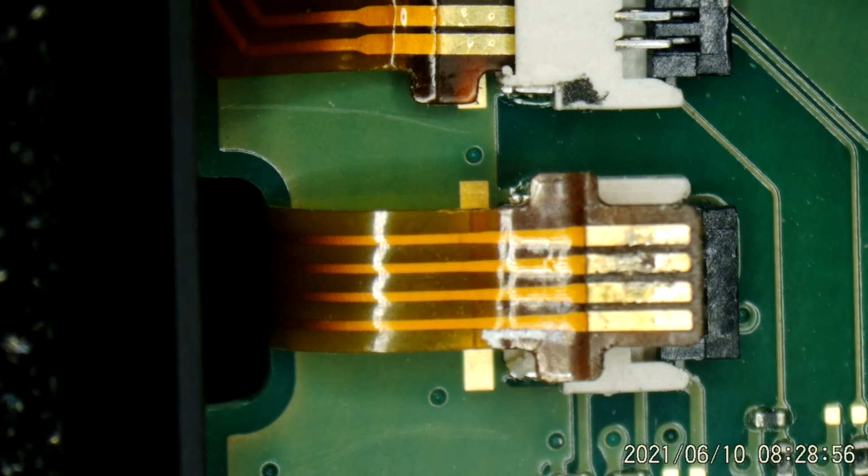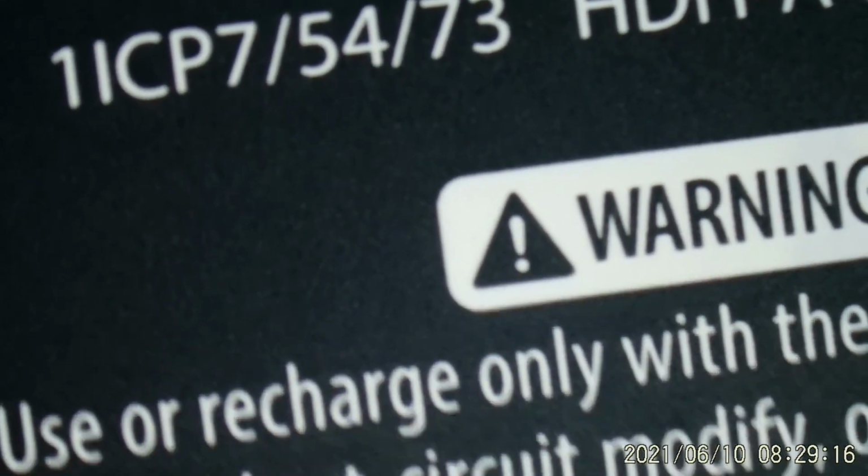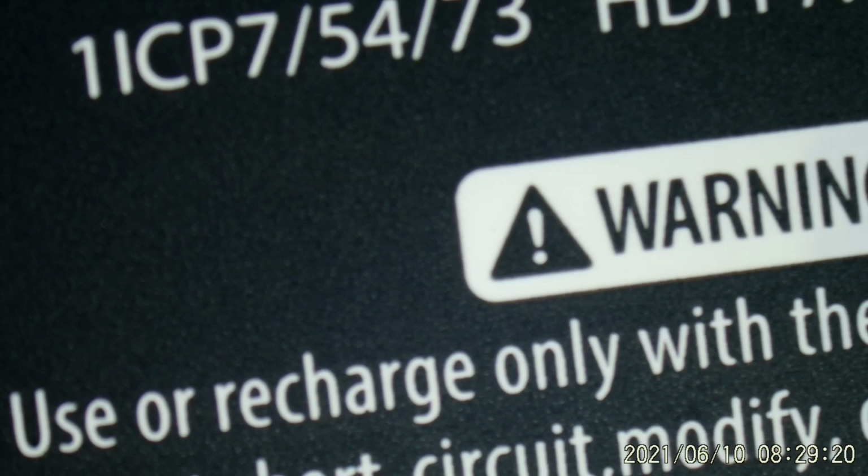I would have sworn I had sound earlier when I was testing and got it up and running, because I could slide my finger across the front and hear a little clicking sound coming out of the speaker. But I got it all back together, no sound, and I think I finally figured that out. Holding a flashlight to the screen, I noticed that when I hit the volume button, it gave a little headphone symbol. I didn't have headphones connected, so it thought that there were headphones connected. And so it would always route the audio out the headphone jack instead of to the speakers.